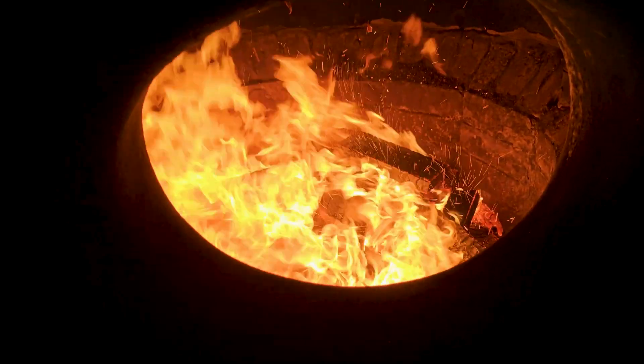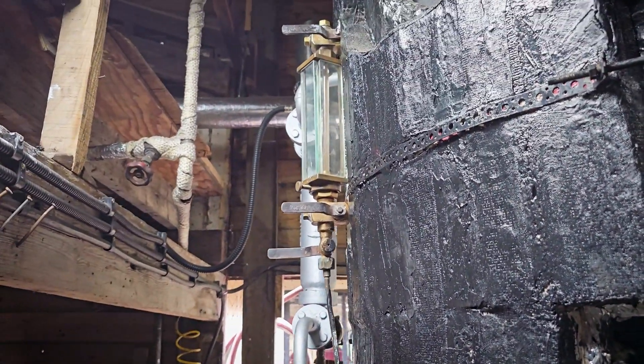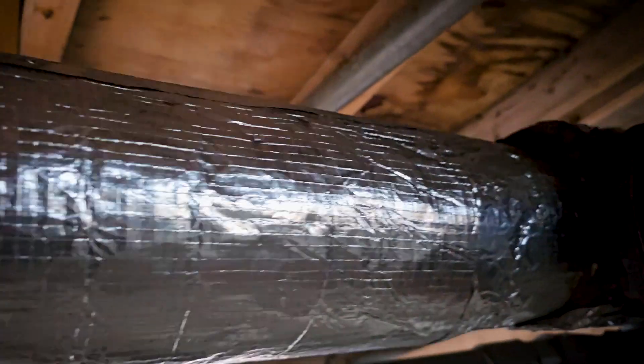So you can see we've turned the blow off the fire to low now. We can see that we've got a full glass of water just slightly off the top, but that's because we're going to do a blow down in a minute. And I'm filling up the header and the hot well tanks for next time. So I'm going to just go up here and close off the crown valve, which means that nothing else will run with the exception of the boiler feed pump, which isn't fed from here for obvious reasons. So that's done. We'll show you blowing down in a minute. We're at the end of the day now - most of this is left, we've finished our tours, so we're going to put the boiler to bed. Fairly simple procedure, which I'll show you now.